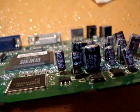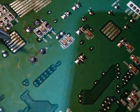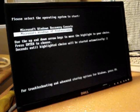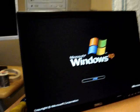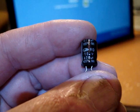The new capacitors are soldered in. Just double check your solder job on the back — make sure the capacitors are tight with no movement. These solder joints all look good, nice and tight. I've just fired up the computer after installation and the flickering is gone — from two small capacitors. These two small capacitors were causing all the grief.